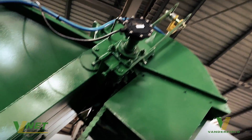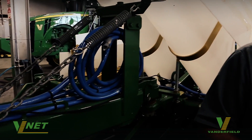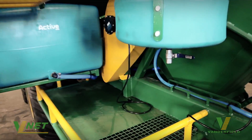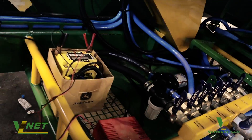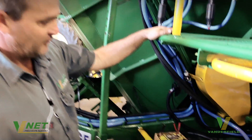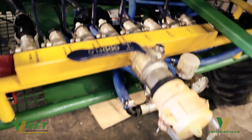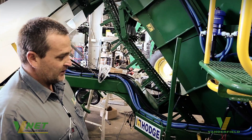The reason the customers engage VNet to provide this custom technology solution is so that by using variable rate application we get excellent placement of the sugar cane in the ground. With the liquid system we also have some form of proof of placement, which is used for accurate record keeping down the track. We've got the 12 volt flow jet pumps here regulating flow for our two liquid systems — one delivering 1000 litres per hectare, the second 100 litres per hectare — and we're controlling those with a solid state relay changing the voltage input to the pumps.